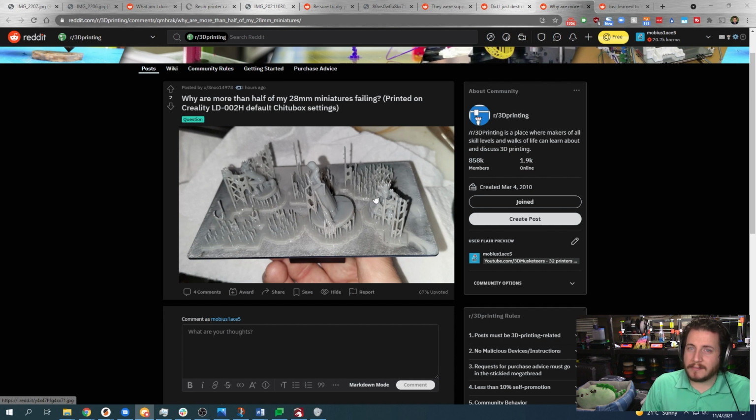You do clearly have some stuff stuck to your FEP, so make sure you get that off. You can print a plastic scraper. Do not use a metal scraper. Sometimes printers come with the plastic scrapers, try to pop it off the FEP. You can do that with resin still in the printer, or you can drain the resin. If you've got time, drain the resin. But drain it through one of those paint filters that come with most printers. Those paint filters will make sure to filter out any chunks of print that might be floating around in the resin. Then go ahead and clean everything off that FEP.